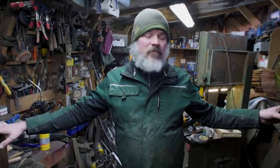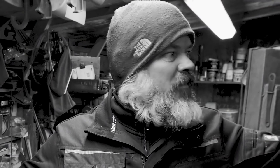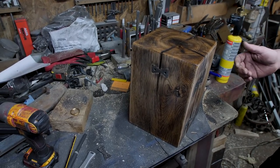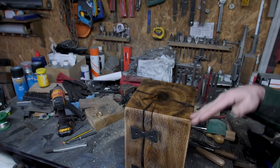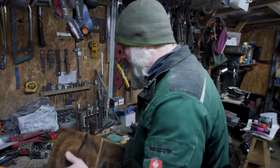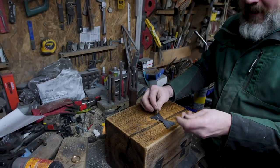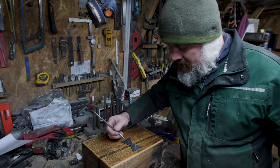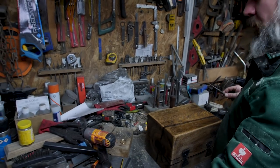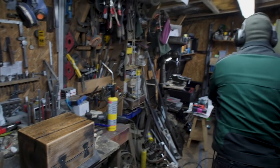I've sorted out our problem with wiring up — sat there and realised we've got to take the lamp to pieces and wire it up from in here. We kind of talked yesterday, we were going to put butterflies in it. I'm so pleased we did because to me they look bloody amazing. I put a coat of lacquer on last night — it's so cold in here today that the lacquer would stay gummy, so it's nice not to have a gummy surface. What I've done is taken the butterfly, positioned it where I wanted it, taken a little impact driver and screwed it on so it's nice and tight, then taken a scribe and scribed around the outside, made a nice neat line, unscrewed it, taken it off. Freehand routing is the way of the chief.